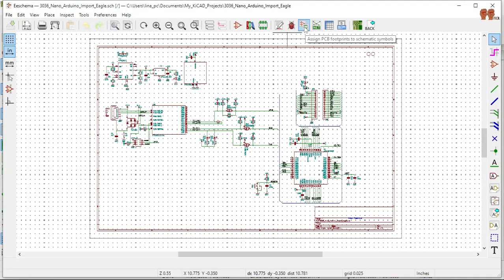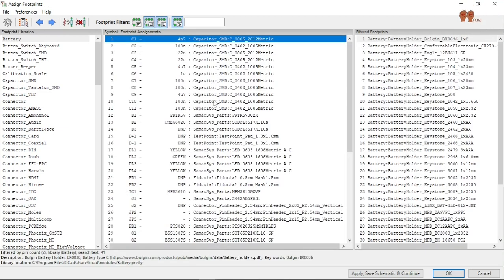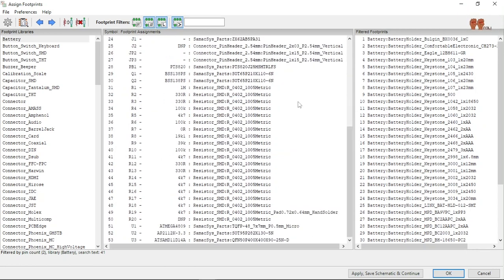That's the schematic. I think it was 0402s. Trying to change for 0805. You see the capacitors here, it's 0402, that's the smallest size. And I definitely don't have the capability to solder those components. I gotta be realistic about where I stand, and what I can solder without a problem.